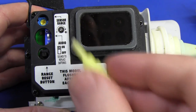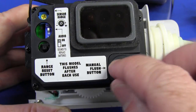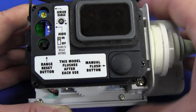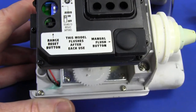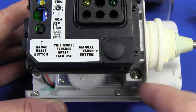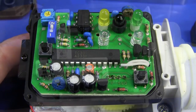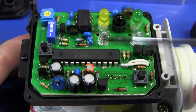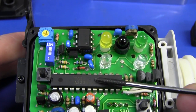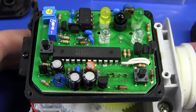This is rather neat. Adjust the sensor range up and down. Audio on or off - hey, I didn't know these things beeped. This model flushes after each use. There's a range test button, so we can adjust the range on this thing. We've got a couple of LEDs - a red diffused filter on the front, and green and yellow LEDs. Just a little micro - nothing more. It's very old school. It's got a big 22-pin 0.3 inch DIP package, which is a TC3024. My internet in the office isn't working at the moment so I can't check that. There's another 8-pin chip and a couple of status LEDs, and obviously an infrared transmitter and receiver.